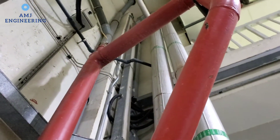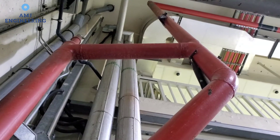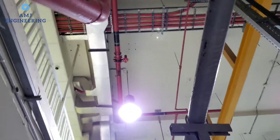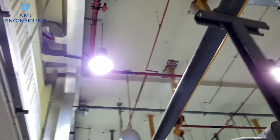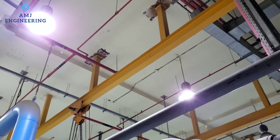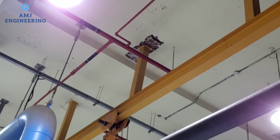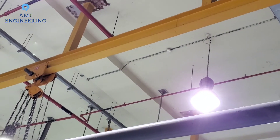Another branch is connected to the sprinkler system, as you can see. There are three common reasons why this additional water supply may be necessary: a closed valve on the domestic water supply leading to the sprinkler system; inadequate domestic water supply being delivered to the sprinkler system; or a change to the occupancy of the building that presents a hazard greater than the sprinkler system was designed to handle.